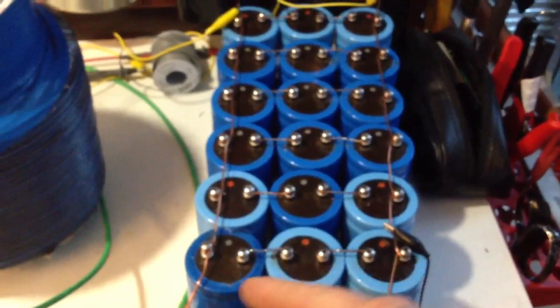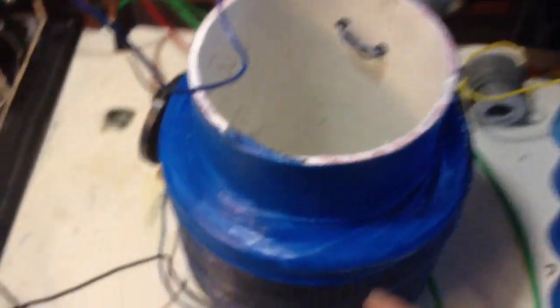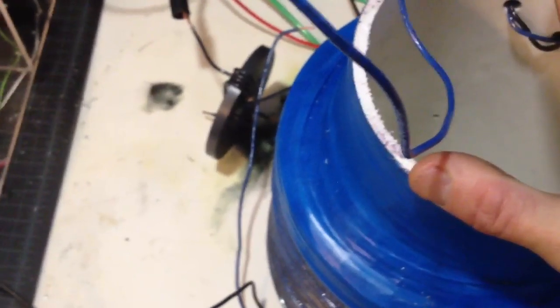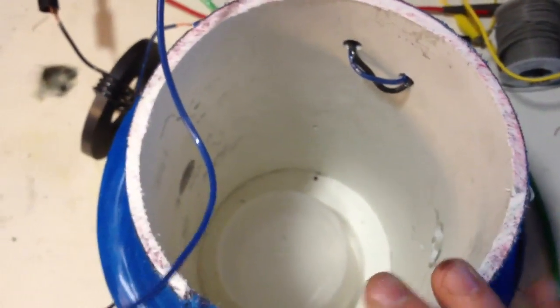That's 3,000 microfarads at about 1,350 volts, with all rows run in parallel. That then gets discharged into the magnetizing coil right here. There's a small inductor on the side with about five winds — it's basically transparent to the rest of the current, but it provides enough inductance to help the energy transfer into the coil. You basically put whatever you want to magnetize inside the coil. This is a bifilar coil.